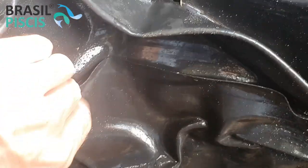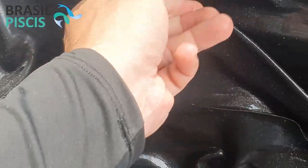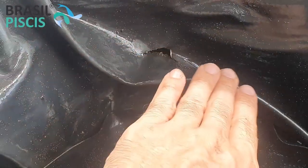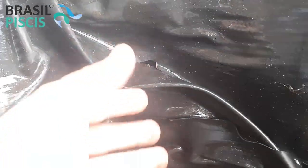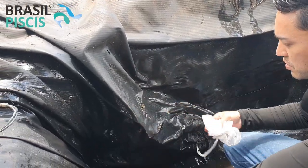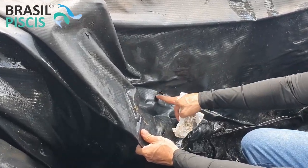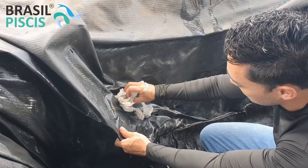It's important you always try to keep it flat. The problem here is that the bull tore it right on a fold. But since our material — this here is reinforced braided PVC — you can see it's very flexible. So since we have the advantage of the material being flexible, I'm going to try to remove this crease, push it down so the repair is on the flat part. I just did it like this to remove the crease. The material is very flexible, different from some other membranes. Just wipe it with a cloth. You can see the tear is quite large — almost two fingers wide on each side. Clean it very thoroughly. It doesn't matter if it stays a bit damp.